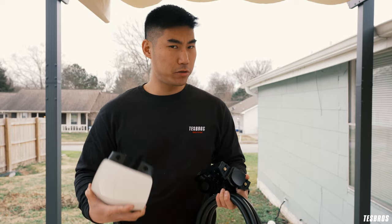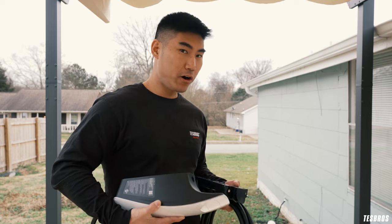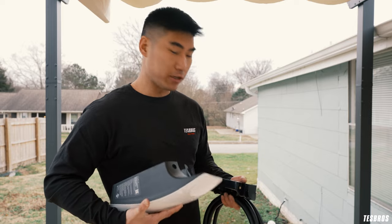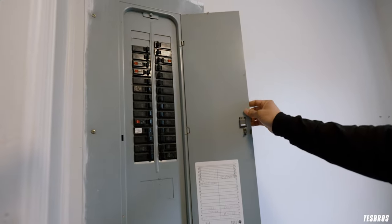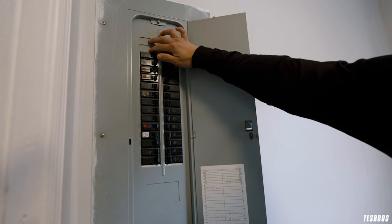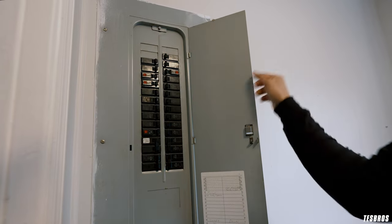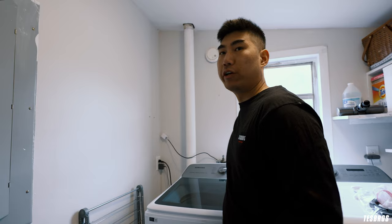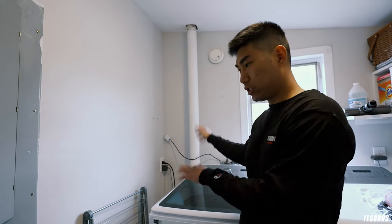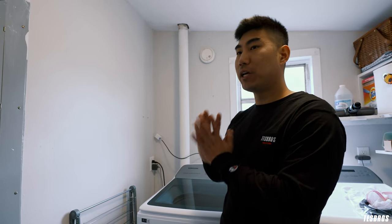Let's talk about what we were originally going to do and the nice surprise we found. We're bringing in our electrician Michael — he does a lot of work in Chattanooga. If you're in the Chattanooga or Tennessee area and need a charger installed, he'll hook you up. Most homes have their breaker in the garage or laundry room. We have a standard 200-amp breaker, and this is going to need a 60-amp breaker taking two slots. Originally we planned to run wire from inside through the drywall and out via exterior conduit, but then we found we actually had a breaker panel outside — which makes things so much easier.